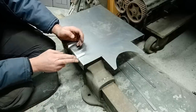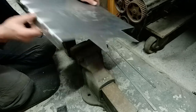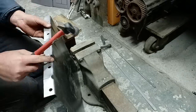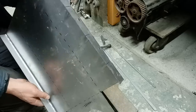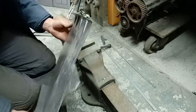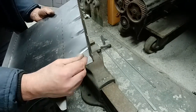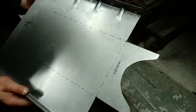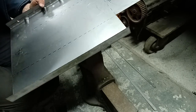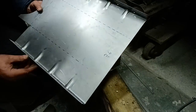So we just get a hammer and dolly on to tidy the end up now, and then we'll work on to the other side. And that straightens up all the wobbliness on there. And when we come to turn our lip on this down here, that'll straighten that up even further again. So doing the same thing now, I'll crack on and put the holes in and the relief on the other side. Right, magic of editing, that's both sides now done.